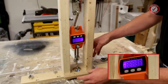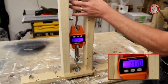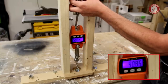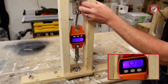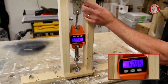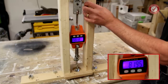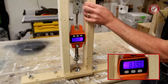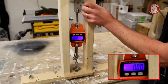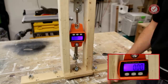This is a much smaller screw than we've tested before so I'm not expecting it to do anywhere near as well — but we're already past 50 kilos... 60... no way... we're past my body weight, and there it is, gone. Around 80 kilos. I'll need to double-check the footage on that one. Didn't expect that for such a small screw — that's crazy.